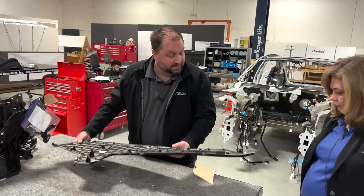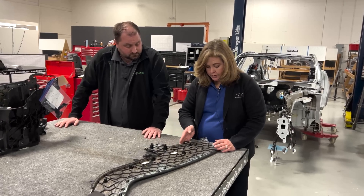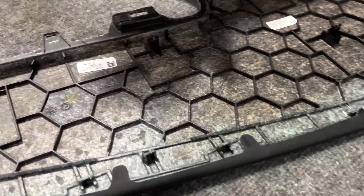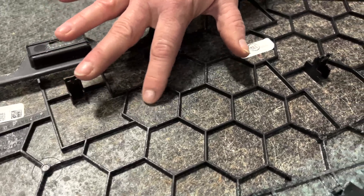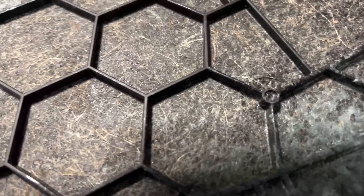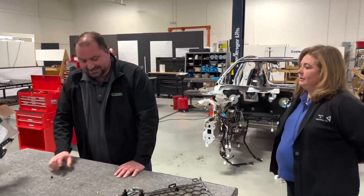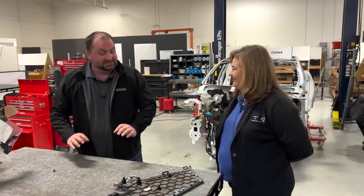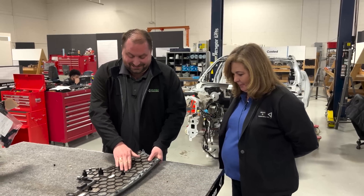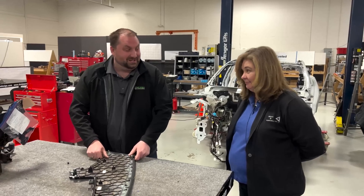Which makes this very very lightweight. And not only that — when you're talking about this reinforced formed material, what you're seeing in there, you can see the fine grain structure — it's a natural material. Which means that this is more green than if we made the entire part from plastic. So using this natural material, and that can be anything from bamboo fibers to cork particles — there's all kinds of different plant material used in here. Ten years ago when I was in a research group, my boss came over with a five pound bag of hemp and dropped it on my desk and said, separate my stems and seeds. And that was actually an important thing because you do want very consistent fiber size. You don't want anything big and chunky getting stuck in there and messing up how your compression molding works. But I thought that was hilarious when he did that.